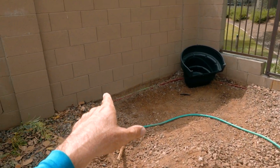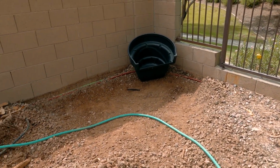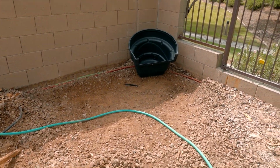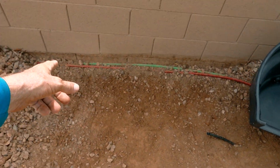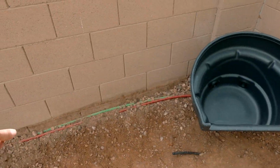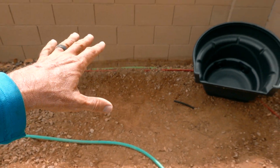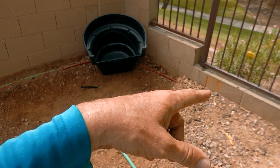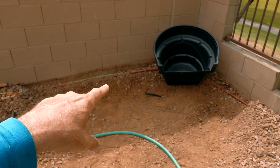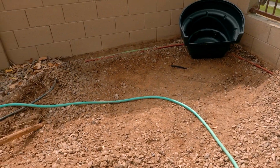We've got to build a retaining wall to help keep that pressure and moisture off of the existing fence block wall. And then what we're gonna do, this is a fairly new irrigation line, so we're gonna cut that and reroute it up and over so it's not underground under several layers of dirt and rock. So if there is ever a leak or it needs to be tapped into, it's not this low. So we'll cut that, splice it, run it up and over, and get to building that waterfall after we dig the pond, of course.